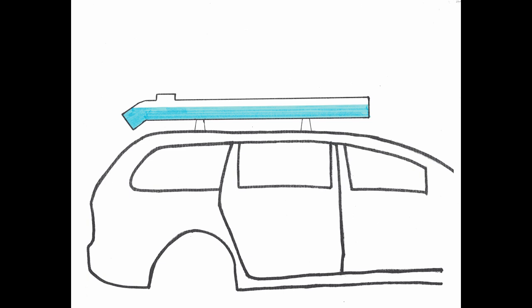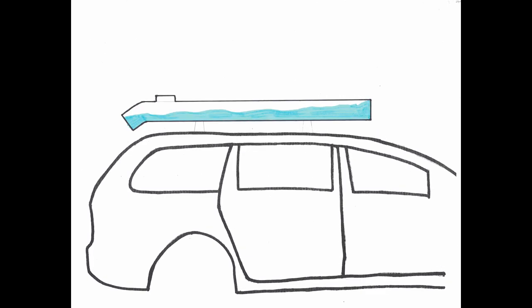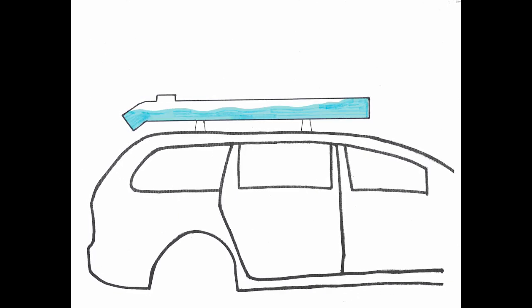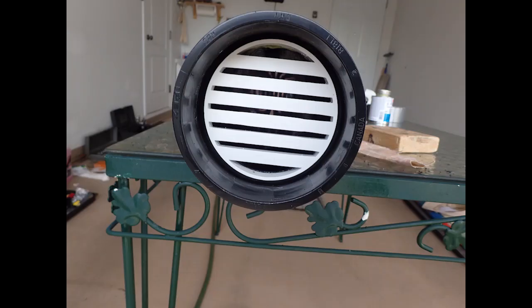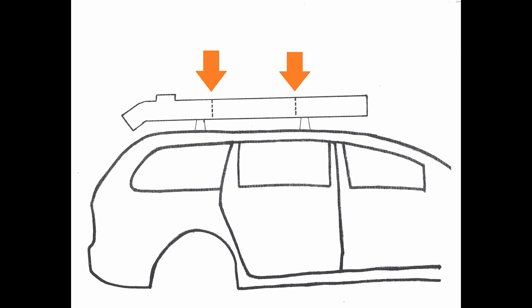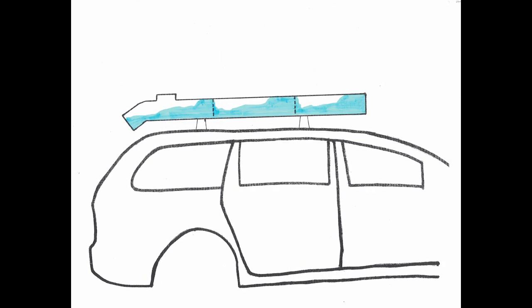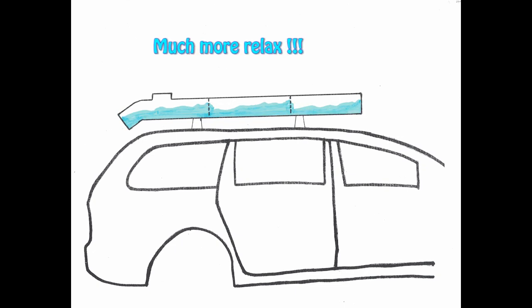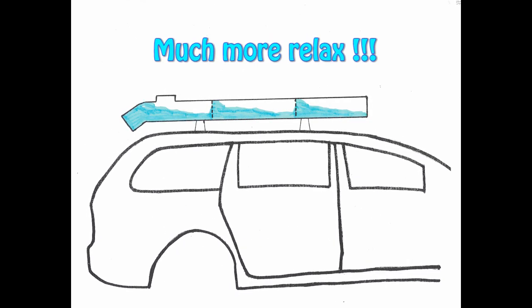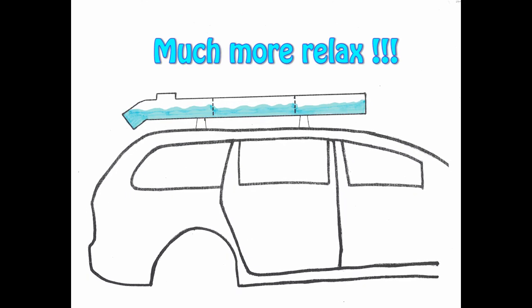What we want is to reduce those impulses and destabilizations. They are hard on everything that holds the water tube. Here's what I did to avoid this. I divided the tube in three sections and I separated those sections with two water restriction discs to slow down the water velocity when braking. I placed those discs with their slots at 90 degrees to slow the water velocity even more.